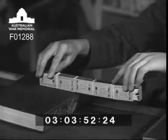Suppose these two books represent a gap which has got to be bridged, and each of these matchboxes, a bay of the bridge. The bays are assembled together on the bank to form a bridge of sufficient length to span the gap which has got to be crossed. Like this. Then the bridge is pushed forward by the sappers on its rollers until it reaches the far bank, like this. Now, there are two snags about this.